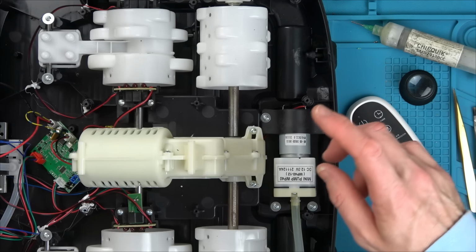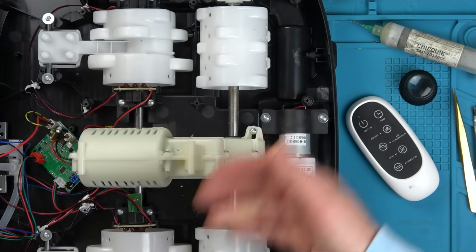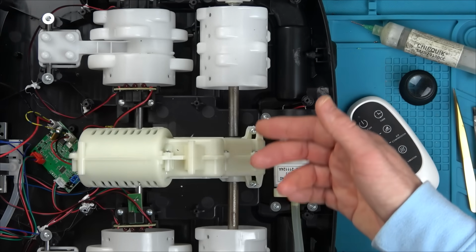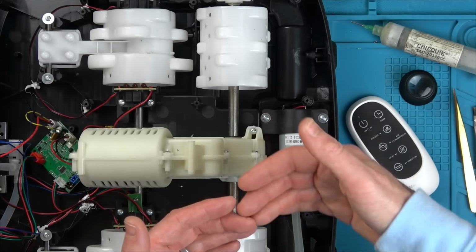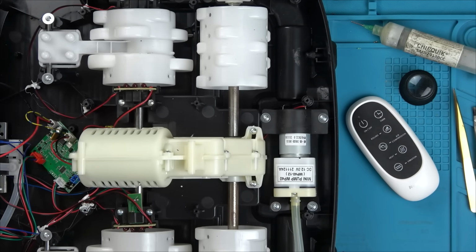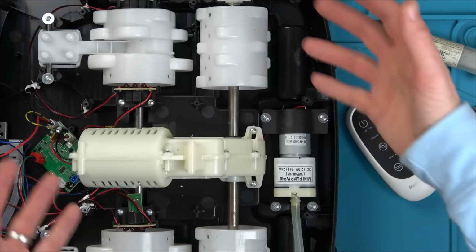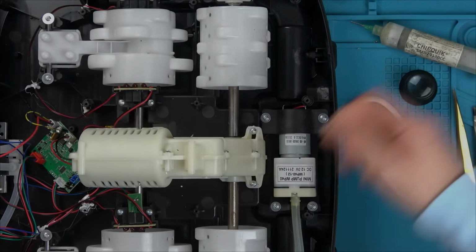So, what's the problem all along? The problem all along, if I tested the MOSFETs, I would have got it a lot quicker then. The problem all along was the MOSFETs, and the only reason it started to work is somehow I blew the resistor, maybe when I was inputting voltage, maybe my leads hit together or did something, and whatever it is, it blew the resistor, so it cut the path to that MOSFET, and that's why it livened up the lights. So the problem all along was the MOSFET. I'm certain of it. Excellent.